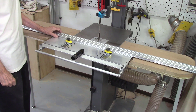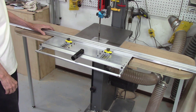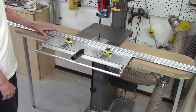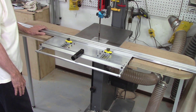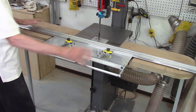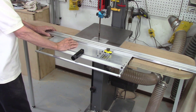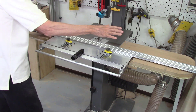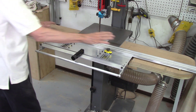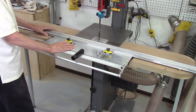The next modification I did to my bandsaw was the addition of left and right-hand extension tables. The construction of these tables is described in a previous video listed in the description. The main purpose of these extension tables is to reduce vibration on my long rails. These long rails tend to overhang the table by quite a bit, and when you put a sled on with a piece of wood, you have a lot of weight, the rail can sag, and more importantly, you can have a lot of vibration. By supporting this rail, you eliminate the sag and also reduce the vibration, resulting in smoother cuts.